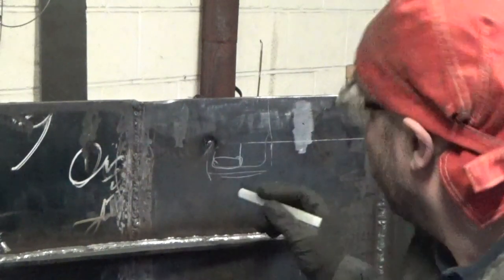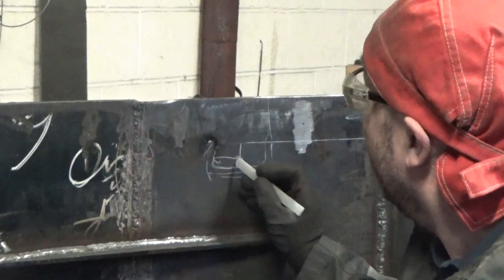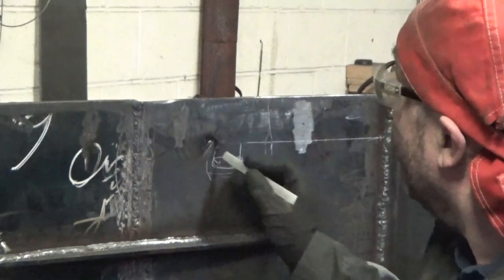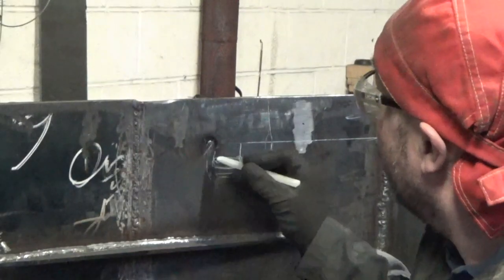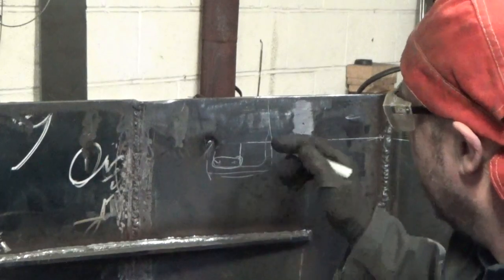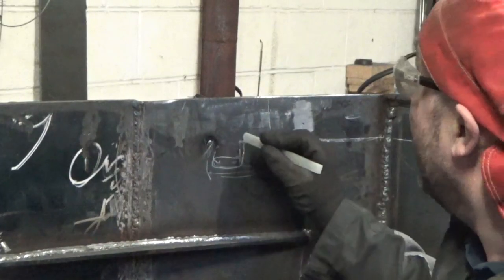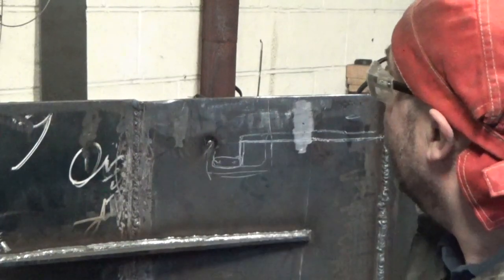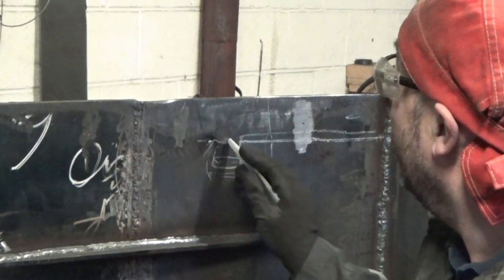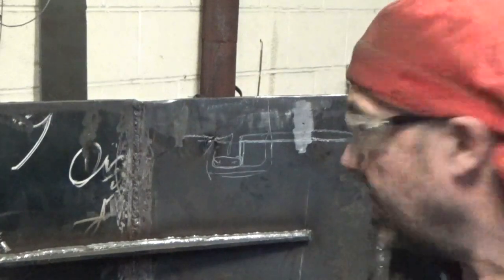So what I'm going to do is pop a couple of holes here and here, 14 mil. So I get a hole at each end. And then we can cut the line out in between. Then we'll get a slot. Because once this is in, I'm then going to put a plate up here. So the plate on this back side will fit like that, and then the top cover will come in and go down like that. The removal cover. So you just need a slot like that to allow the water out,